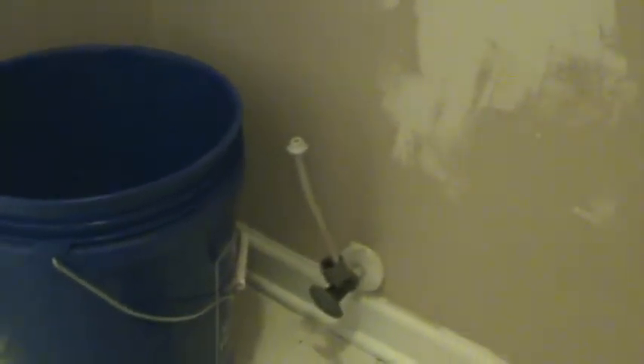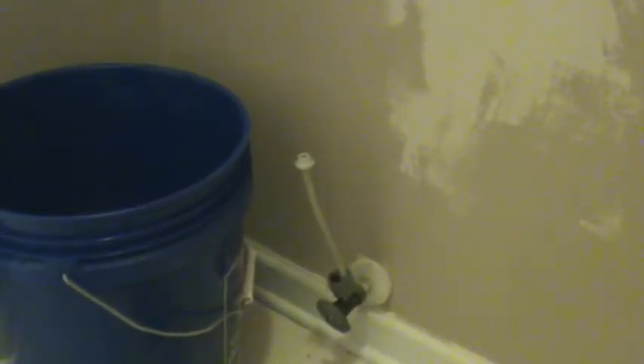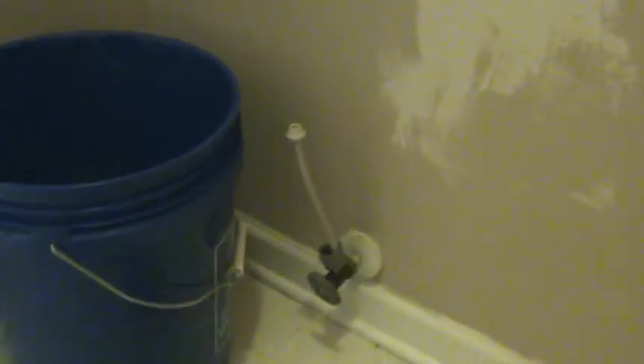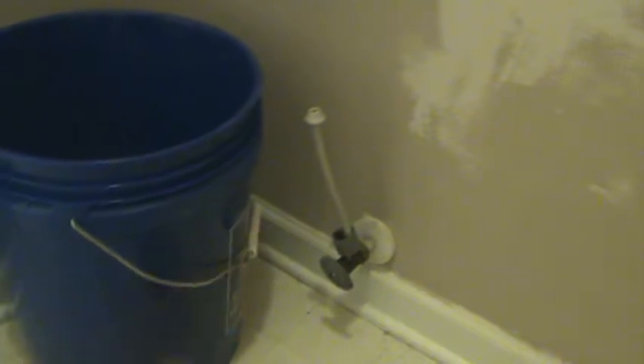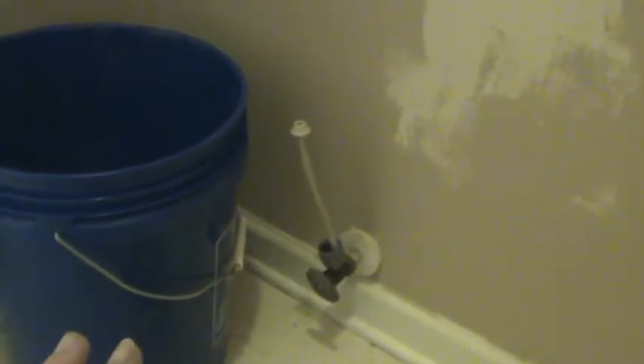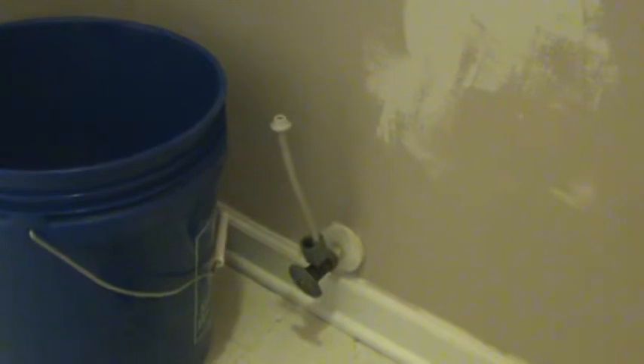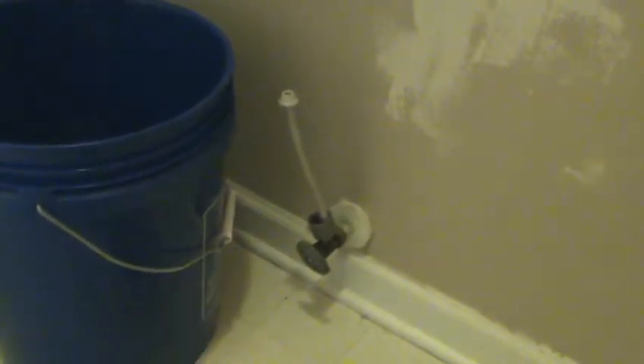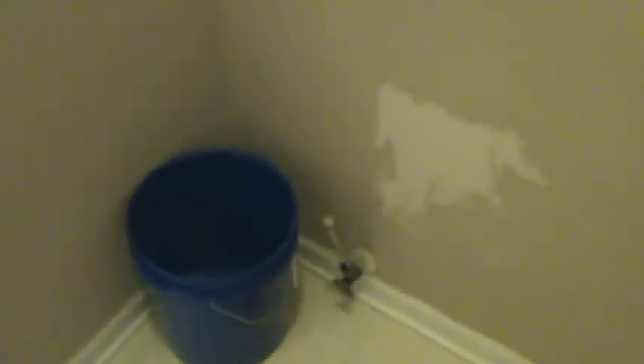This supply line right here is another good example of being cheap and kind of silly on a house. This little supply line is polybutylene — they outlawed that stuff for main supply lines to the houses, but legislators and lobbyists in Congress allowed it to be used inside the houses. This little supply line is about a 79 cent part at Home Depot. The problem with these lines is that over time, the chemicals in our drinking water end up corroding these things on the inside and they'll get little pin leaks in them. That's a pressurized line, so when it leaks, it's going to leak all over your house.